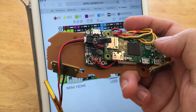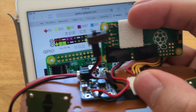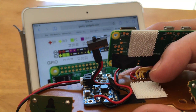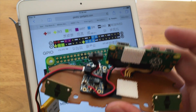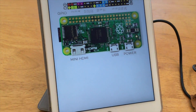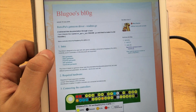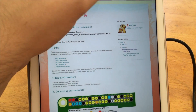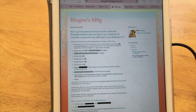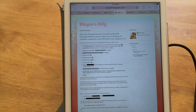I did the same thing for the Power Boost and used electrical tape to cover things up — you can see the electrical tape at the bottom. I should probably use hot glue to clean those up in case anything shorts. Once everything is wired up, the last part is software. A GPIO driver README was very helpful, along with a blog post from someone who did this with a Nintendo 64 controller, which you can adapt easily for a Super Nintendo controller.